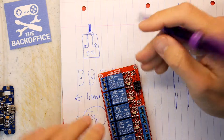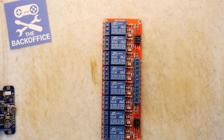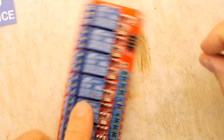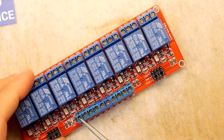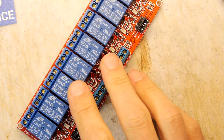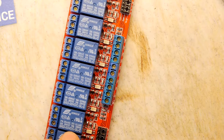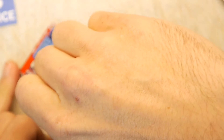Just looking at this relay here — it looks like it's been a little bit damaged. These are probably reconditioned or salvaged relays. While we're here, we're just going to test the board out. The board has some markings — I'll zoom in so you can have a look. We have low, common, high — this is probably choosing whether it's activated on a low, common, or high. Here we've got DC plus, DC minus, and then all the inputs. I've got a power supply next to me, I'm going to go for three volts. I'm hoping it's three volts because 3V3 is kind of easier to work with.